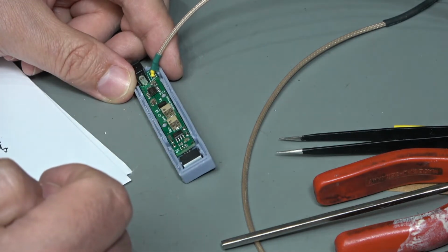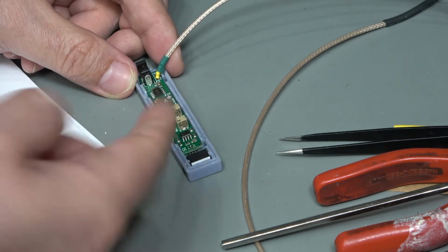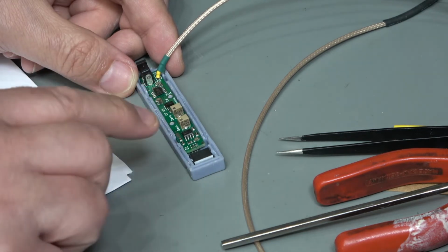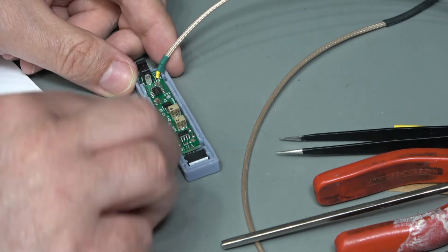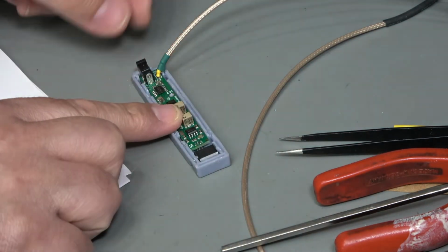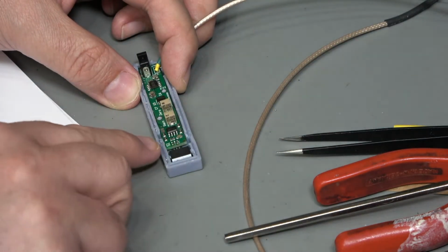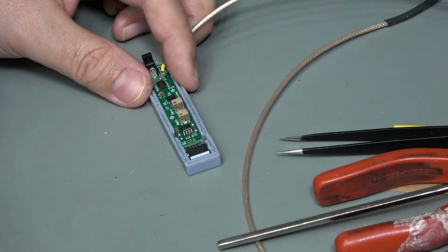So the design can be, I've put the ferrite in first and then fitted the sensor to fit. What we really want to do is to solder the sensor onto the board with a plastic spacer so that everything ends up in exactly the right position, put the board in and then pop the ferrite in afterwards. It will still lift out because it will lift out from this end here. I need to pull back this ground, and there's a 3mm bend on that. So that's great.